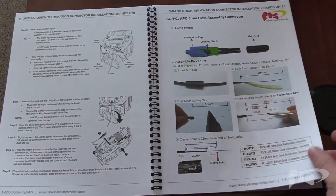So if you're a former student, you might want to look at taking the class again. We've got some new stuff: OM5, SWDM, the new small form connectors. We cover MPO and MTP connectors much more thoroughly, the ABC patterns, and why we would use them.